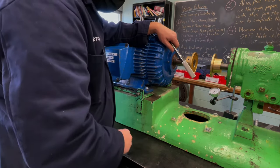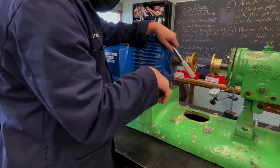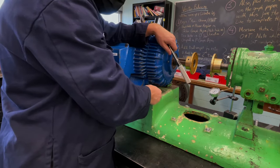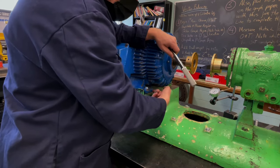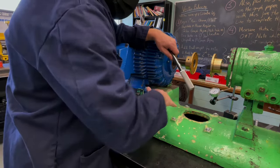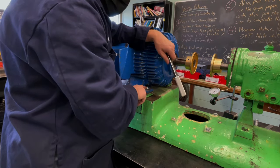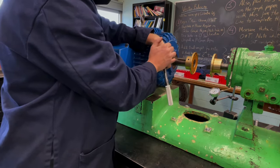Now that all four bolts are tightened, we removed the obvious soft foot and torqued the feet to 50% (theoretically 100% in a real situation). Next I'm going to loosen off each foot individually and check each one for my final soft foot check with a feeler gauge. I'll look in each corner — checking for angular or offset soft foot. Once I'm done with each foot, I torque it back to 100% before moving to the next one, correcting as I go. We want to keep soft foot within 2 thou.